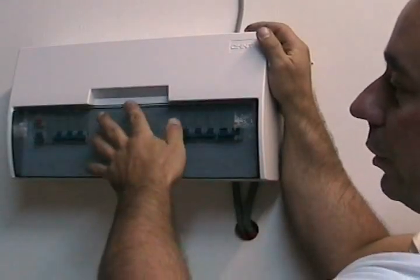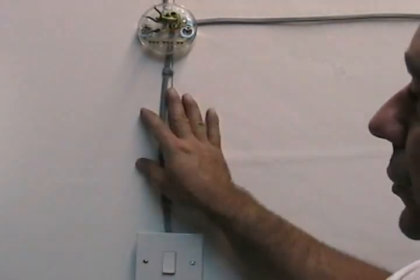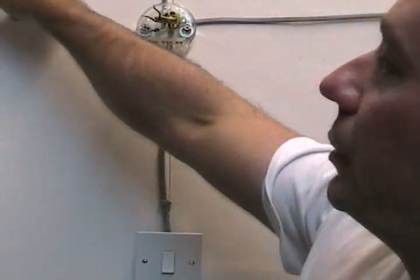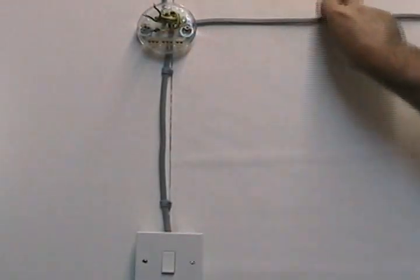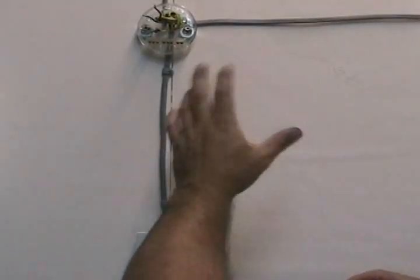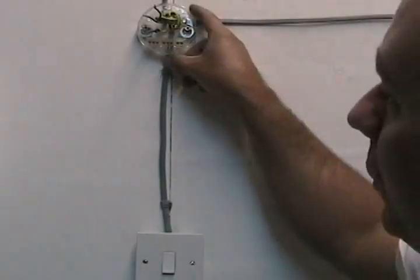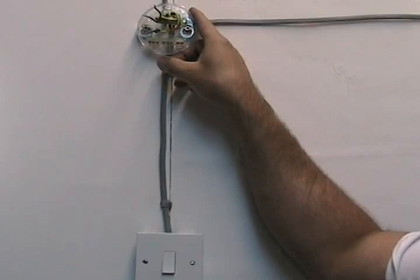It's now safe to work on the circuit. It's quite easy to explain this because the wires aren't covered — I've just rigged this setup up to explain it to you. That's the circuit wire that goes into the ceiling rose and then continues into the next light fitting. You can have quite a few of these on the same circuit breaker, up to a maximum of 1200 watts. Normally you'd have one circuit breaker for the upstairs lights and one for the downstairs lights. If you take a light fitting off and can't get it back on to work properly, all your upstairs or downstairs lights will probably not work.